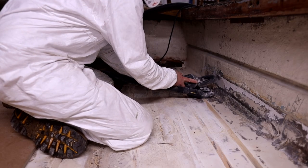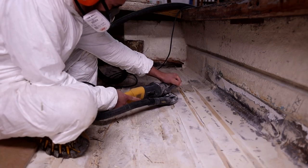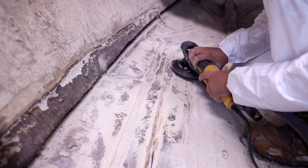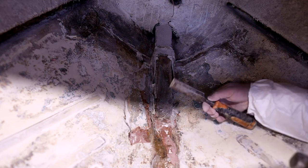Once we'd got all the timber sections cut out, we decided to grind back hard on the existing surface to get a good clean, well-keyed surface to build from. What we're going to do is layer new glass on the inside of this boat to rebuild some of the thickness that's been taken away from the bottom, as it's a really thin skin. We'll be doing that in the coming weeks using epoxy this time, not polyester, to make sure we get a good bond to the existing skin.